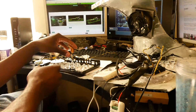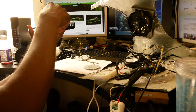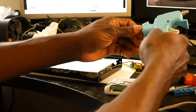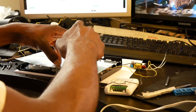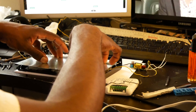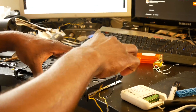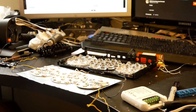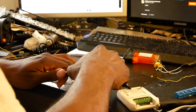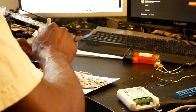But in going with a smaller box, one of the problems I had was figuring out how to cool the LEDs, because they do get pretty hot — I was measuring up to about a hundred degrees and a little above that. Heat kills LEDs, so I came up with using an aluminum plate, cutting it to size, and using thermal adhesive tape on the back of each LED array. I tried a small internal laptop fan but I ended up blowing that, so I went ahead and used a larger computer fan instead.